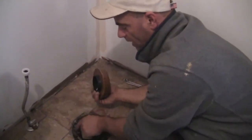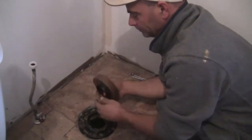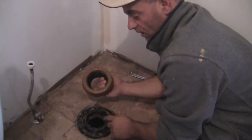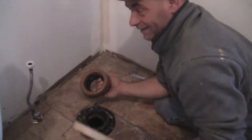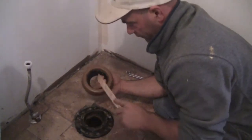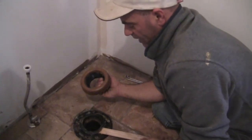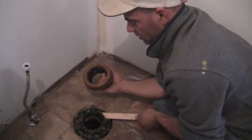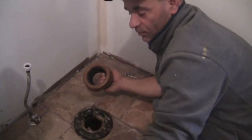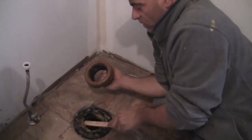I explained how you clean the wax ring. You see our flange is black here — our plastic pipe and our flange on the toilet for our Johnny ring is also black. One thing you want to make sure — because it's easy to make this mistake — if you have an old flange like that, make sure you get it up. I actually left the old one behind to show you, and that would have created a problem for us. There's some more wax in there, so we're going to go ahead and clean this.